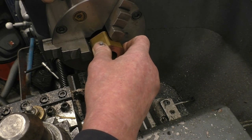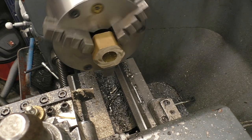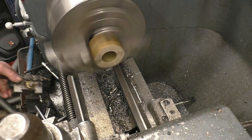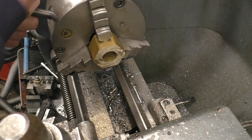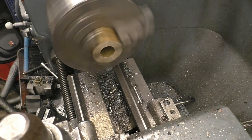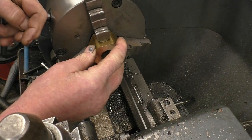Sort of make it — you can tell where it wants to go in, it wants to be a nice fit. Tighten it up on the chuck jaw once again, and hopefully it'll re-face that. Put a parallel against the chuck jaw — obviously the hole is not running through the centre yet, but it will be running through when I'm finished boring it.